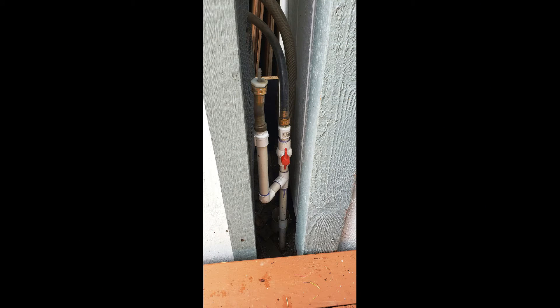The fix is this adapter. Just close the red valve — this will keep water from going into that line and divert it through a secondary hose that goes straight into the storm sewer. Now we apply our pressurized air to the adapter. The valve prevents it from going up, so it's forced down the line, pushing the water out of it.